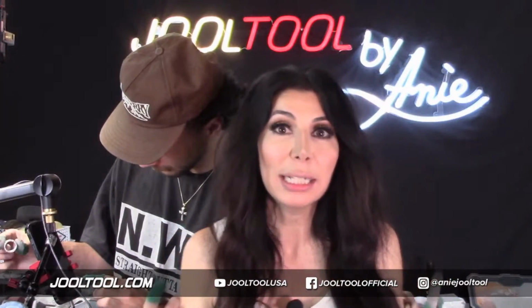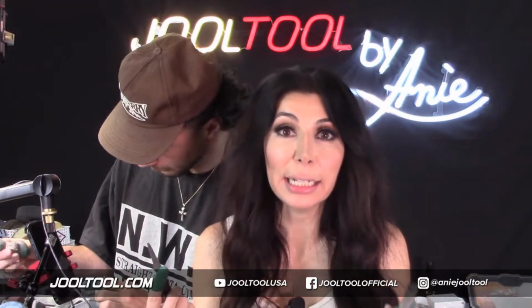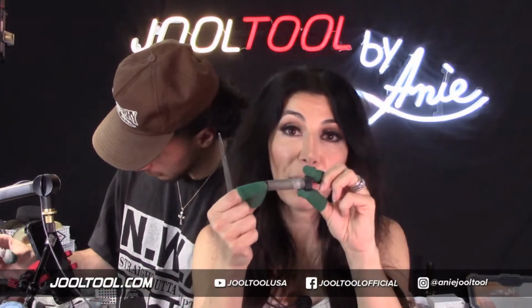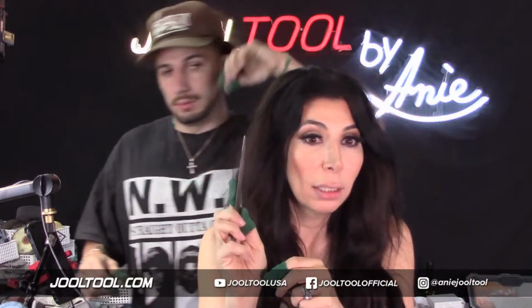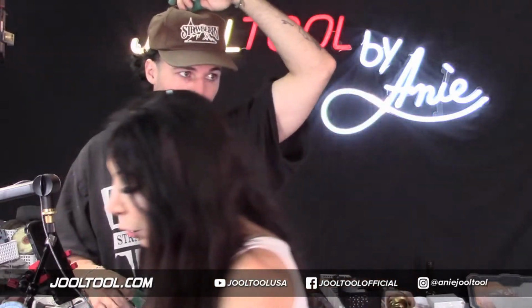Okay, so what I wanted to say is, you guys, if you wanted to remove sprues from inside of a shank, inside of a ring, this made it so much faster. I used the coarse diamond mandrel, but if you don't have this, your other option and only option really to get them all down fast is a half round hand file. Well, it's not fast, but you would basically do this over and over again.